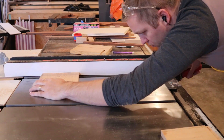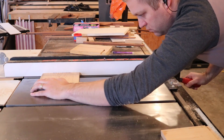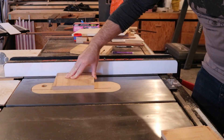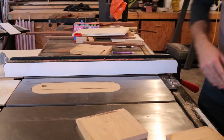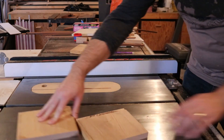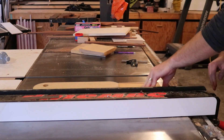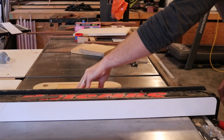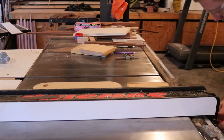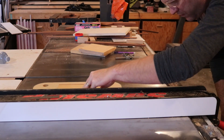Here I'm setting up to cut the end of the dovetail, or the reference point — the shoulder of the dovetail will sit. And in order to get the correct angles I need to switch the fence to the other side of the blade. Still not changing the angle of the blade, but changing the effect of the cutting angle on the work piece.